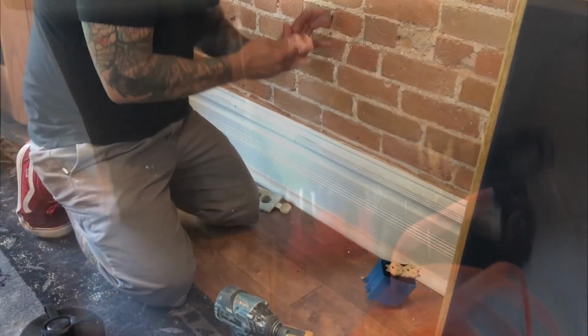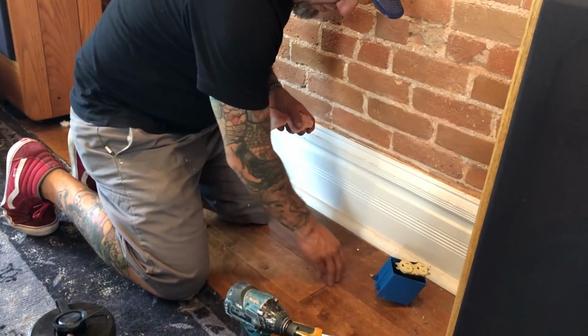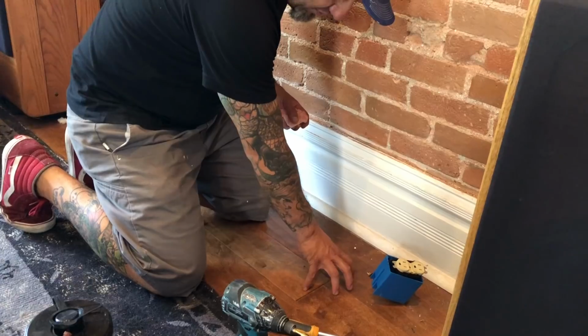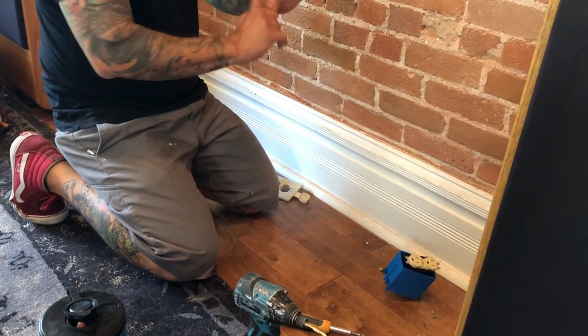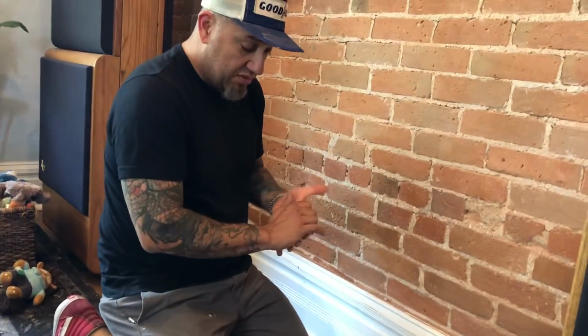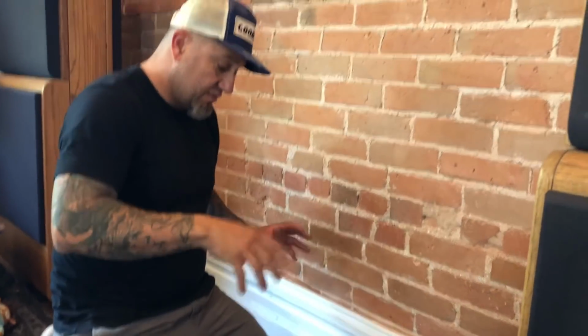Great. So I'm going to measure. I think the stud's around right here, so it'll probably put me somewhere around here. Round brass box, I'll show it to you. I'll pull out my drill and we'll drill some holes. As soon as we get that set, I'll take the wire downstairs, try to get as much length as we can. We'll probably run it through the house so it's straight and flat, not coiled, and then I'll pull, and I might have you assist me on just feeding it.